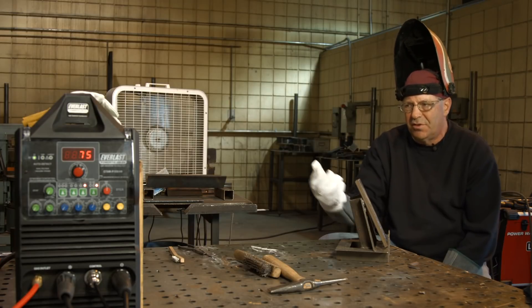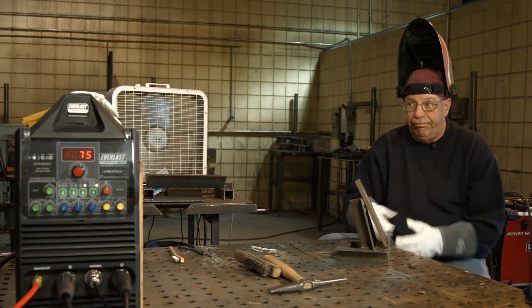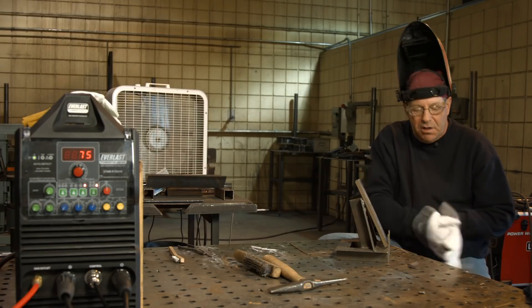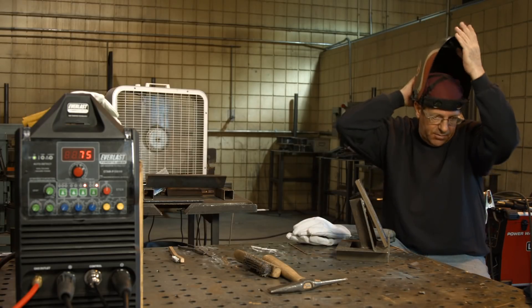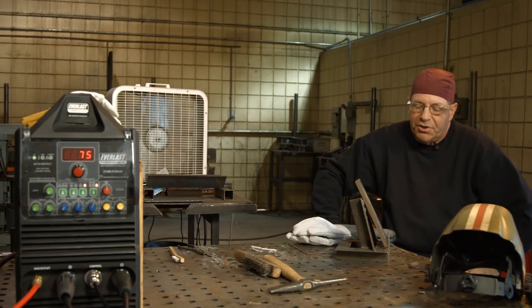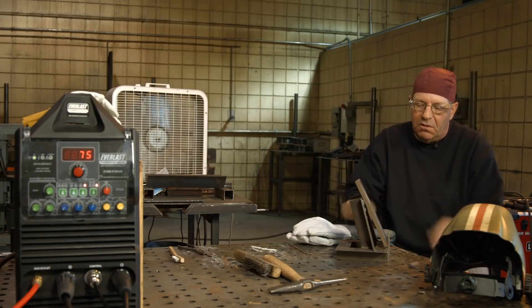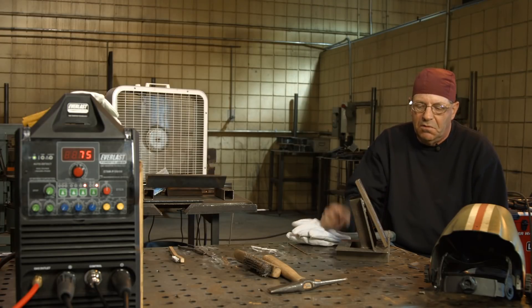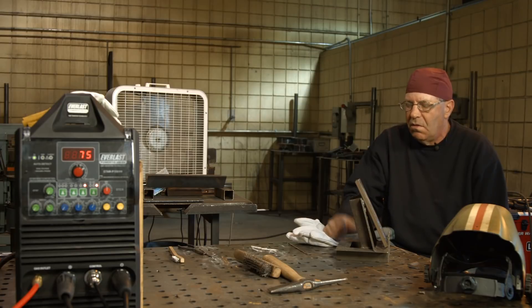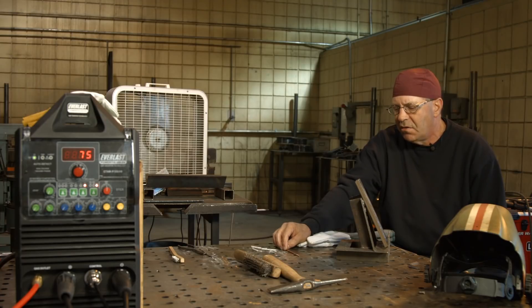I can pick the machine up and carry it around, plug it into 110, hook it up to DC and do some stainless work. Again, we've simulated a procedure here that's synonymous with piping as well. We just did this in the 3G position, but we could be doing the same thing on pipe for 5G — it's all the same thing. Technique and filler wire are the same on carbon. I hope this helps. Please subscribe to the videos — new videos come out every week. Thank you for watching Weld.com. I'm Bob Moffitt with Cali College.